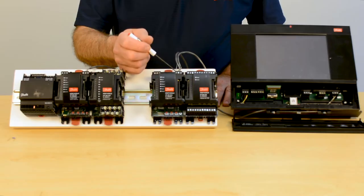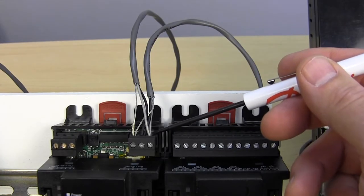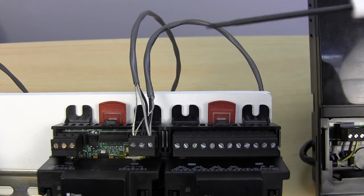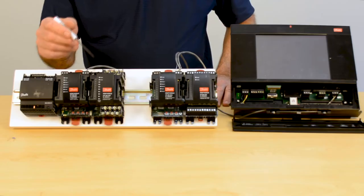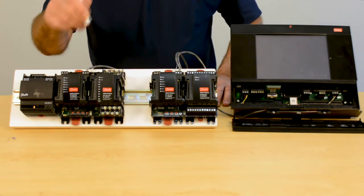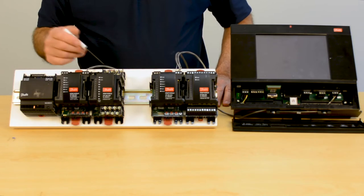When we come to the first module here, we have the same layout: A, white wire; B, black wire; and then the shield. As we can see, it daisy chains — the other term we use is point to point. So point to point or daisy chain on through.